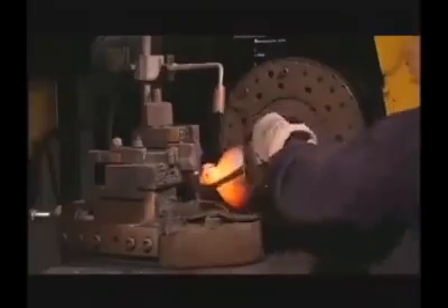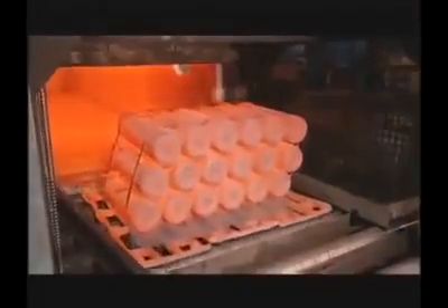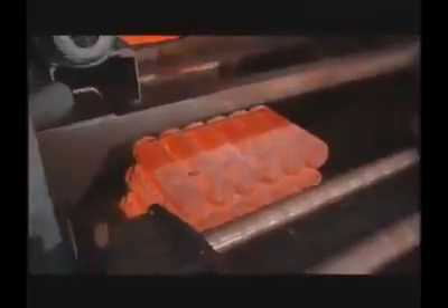Worthington cylinders are closed completely prior to heat treatment, which minimizes interior oxidation for a smoother surface finish. All cylinders are processed through a direct-fired austenitizing furnace, followed by an aqueous polymer quenching, and then a direct-fired tempering furnace. These furnaces are computer controlled to ensure optimum and consistent mechanical properties needed to meet regulatory and customer needs.